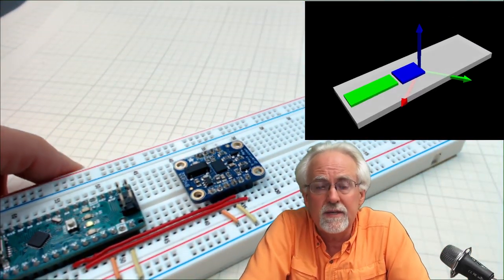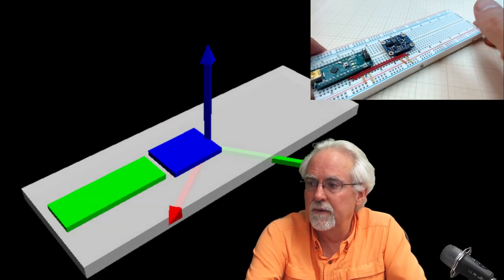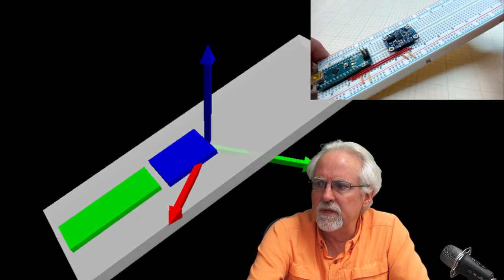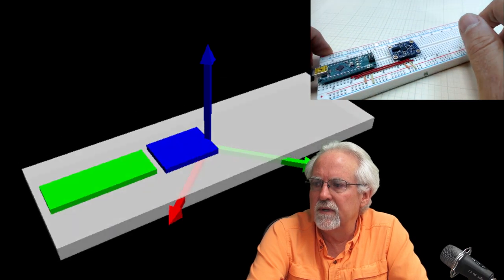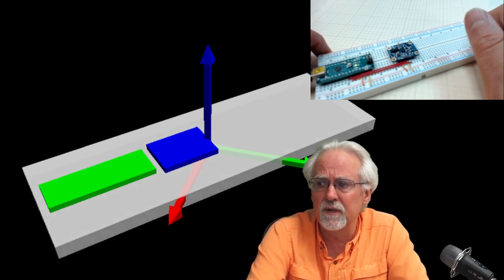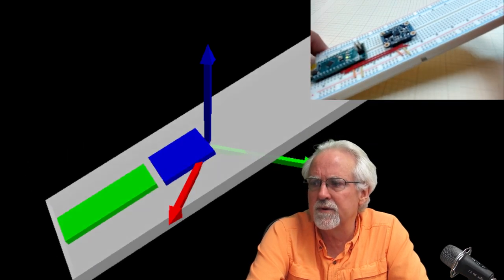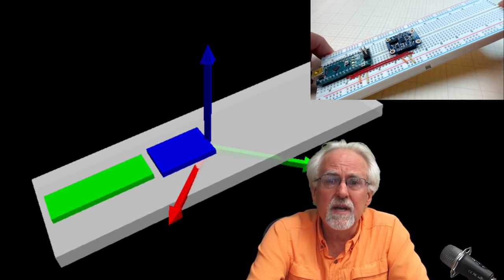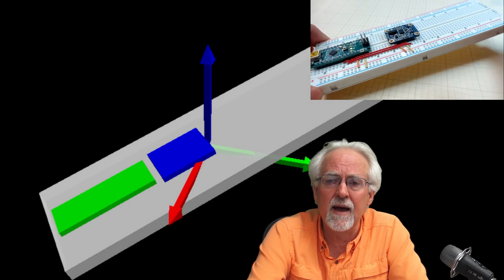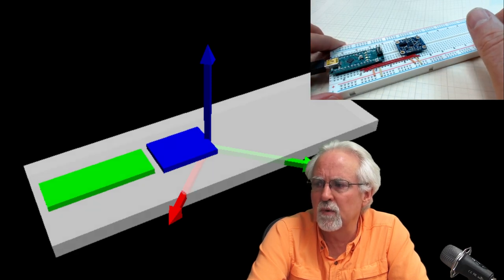What's pretty easy is to do the math using the accelerometers. The acceleration gives you tilt in two axes, and it works as long as you're not moving with real linear acceleration that would be misinterpreted as tilt. But you can also look at the gyro signal — it measures rotational velocity and helps you filter out the noise from real linear acceleration. So combining the gyro and the accelerometer, you can filter out the false signals from shaking, bouncing, or real acceleration.